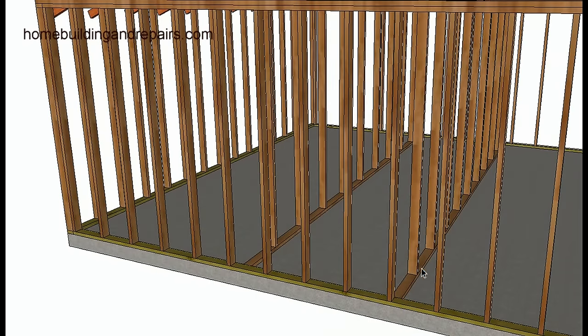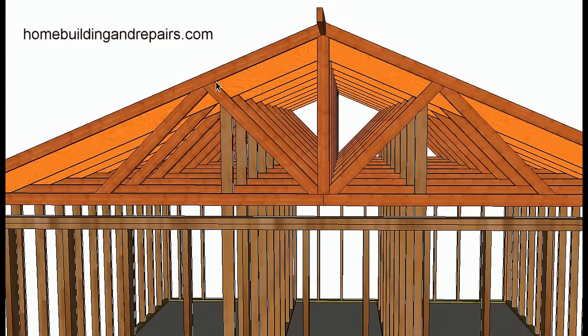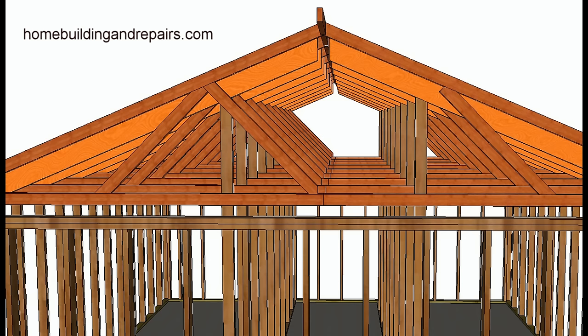The walls — you can see — put a nailer on the bottom. There's a section here that will need to be removed. Remember that the wall and the rafters are now supporting the roof, so you can safely remove the truss. I wouldn't recommend removing all of the truss or too much of it. Just remove a little section — something like this gives us enough room so we can slide our beam on top of the bottom cord of the truss and actually use it to our benefit. The wall is also going to be supported by the bottom cord, so don't get too carried away removing this until you actually have the beam set.